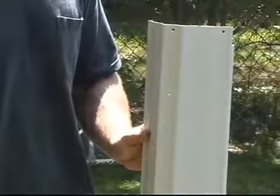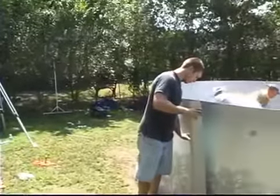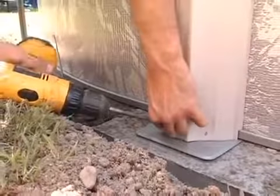Install the curved side uprights onto the bottom plates. The top of the upright usually can be determined by an extra hole in the center or on each side for the top covers. The uprights are secured to the bottom plate using number 10 screws.